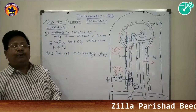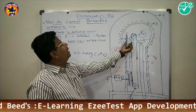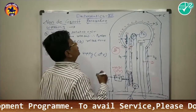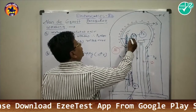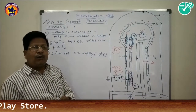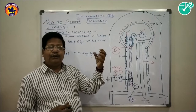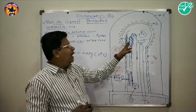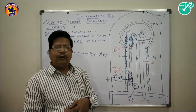and when they reach the center of this sphere, again corona discharge takes place. That means again the air between the comb C2 and this belt gets electrified, and in this case positive charges are deposited on the comb C2, and the negative charges neutralize the charges which are present on the belt. So due to the second corona discharge at C2, positive charges are given to the comb C2. That means it collects the positive charges, and the negative charges which are produced due to the electric wind, or the air which is electrified, neutralize the effect of positive charges on the belt.